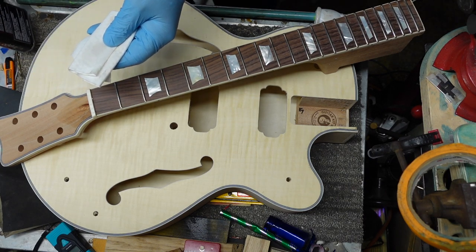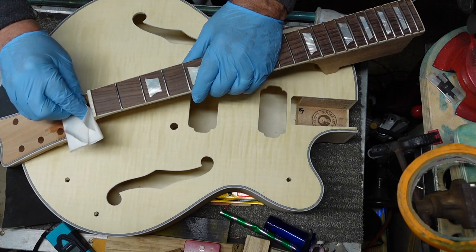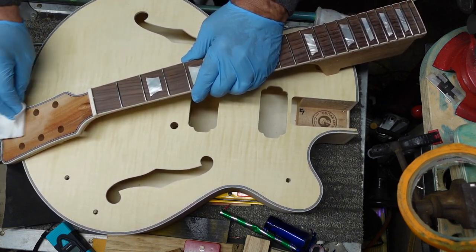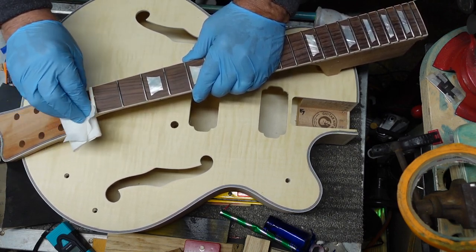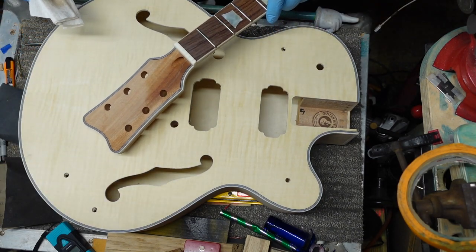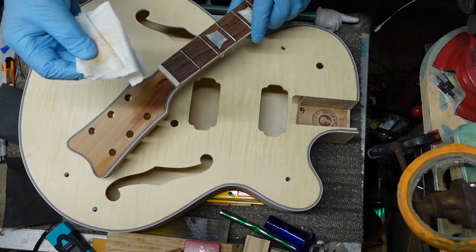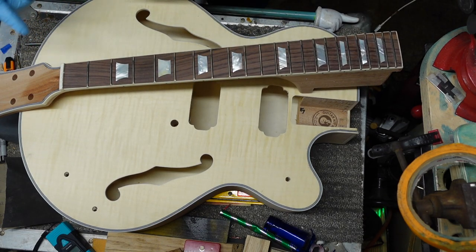So we're going to go along and we're going to take our naphtha replacement. We're going to put it on the rag, the wipe all rag, and we're going to go over this stuff. And this stuff vaporizes off pretty quick. And you just keep doing this until you're relatively sure that anything that could leave a mark on it is going to be gone. You see that's vaporizing off already. You can see it drying out right in front of your eyes. These wipe all rags are lintless, and that's important.